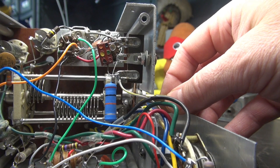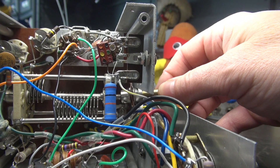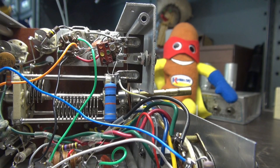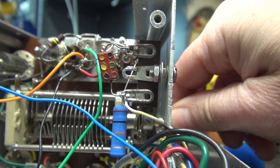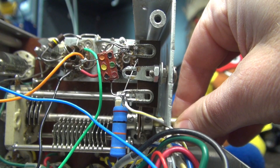So there's the new coupler slid into the case of the VFO. I'm going to move it up onto the cap, and it will slide right back over that 3/16ths-inch shaft. Let me get these set screws tightened and I'll show you the operation of the VFO. There's the coupler in place. Tuning cap turns nice and free — you'll never have another issue with it again. And if you break this coupler, now you can easily replace it. I hope you found some value in that first tech tip on reducing the shaft size so you can use the standard coupler.